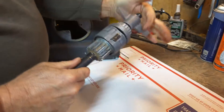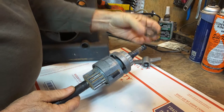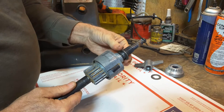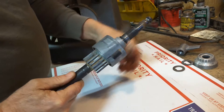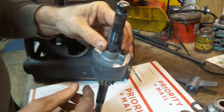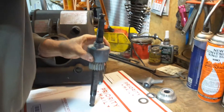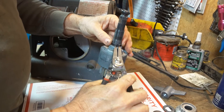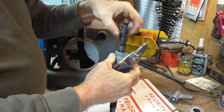Either after or before that, you can take off this wing nut here. Then you have serrated washers on both sides of the depth stop gauge. Sometimes there's a final washer right at the very end. But here you have a snap ring, and to work with the spring housing itself you would have to remove the snap ring with some snap ring pliers. That's kind of tricky — they don't give you a lot of room to work, plus you start hitting these threads, so it usually takes you a while to work it up and off.